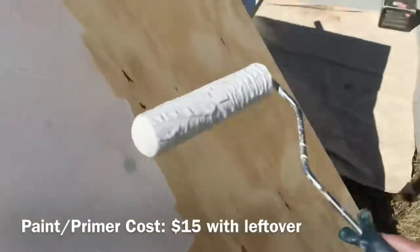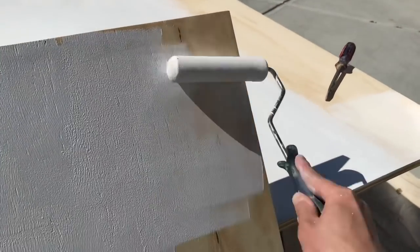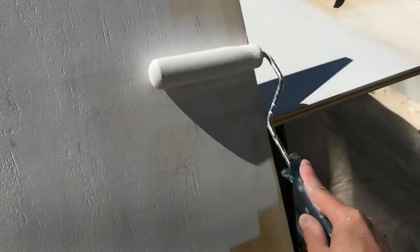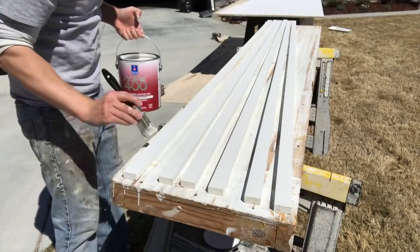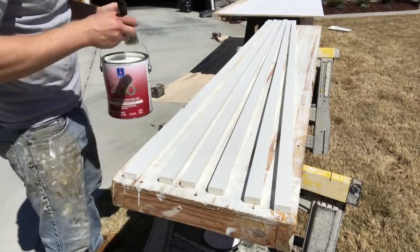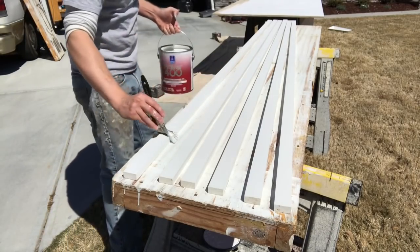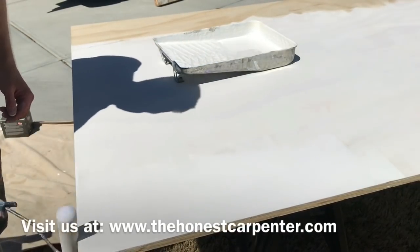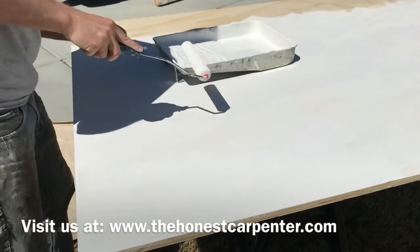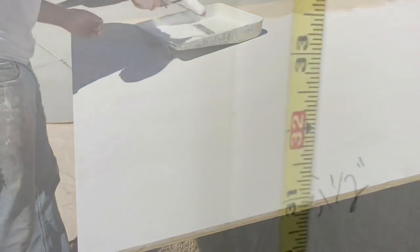To begin, I take a six-inch foam roller and prime the plywood boards that are just raw right now. I like foam rollers because they don't leave that much texture — not nearly as much as a full three-eighths nap roller. While that primer is drying, I switch to an inch-and-a-half brush and get a couple coats of semi-gloss paint on the trim pieces while they're all laid out. You can paint it much faster this way. Then get a new six-inch foam roller and begin putting semi-gloss on the plywood boards and panels — try to do both sides. It's good to do outside so long as it's not windy.